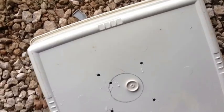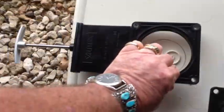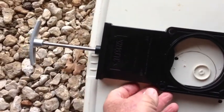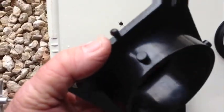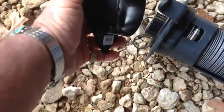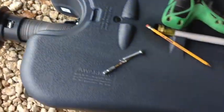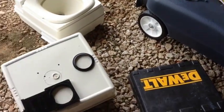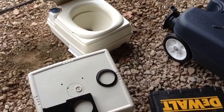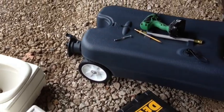I'm drilling holes — this is the bottom side of the tank. I'm going to drill a hole and set a valve right here, just like that. Then on top of that, this fitting here fits into this fitting here, and it'll just be sitting like that on the bottom of a plywood floor. When this tank fills up — which will take a long time out here in the barn because not very many people are using the bathroom — I'll just close that valve, unhook the hose, and roll this over to the septic system and dump it out.